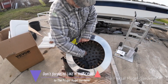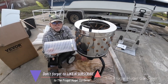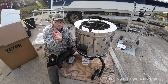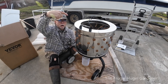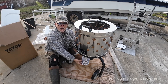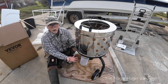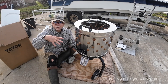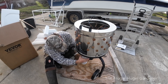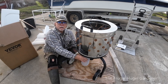That's what the inside looks like — the chicken is going to hit these rubber fingers and the feathers are going to come off. What's also nice is this drain piece goes on the bottom. When this is spinning and the chicken is in there with the feathers coming off, you put the water hose in. The feathers come down and out here into one pile — I'm going to put a bucket under it with holes so the water goes out but the feathers stay in the bucket.